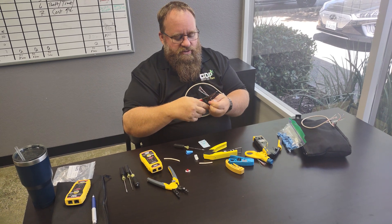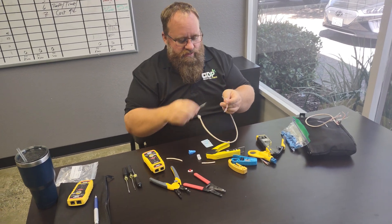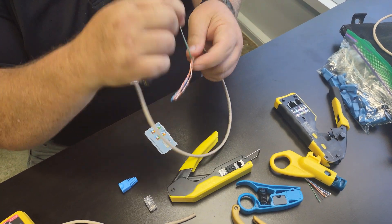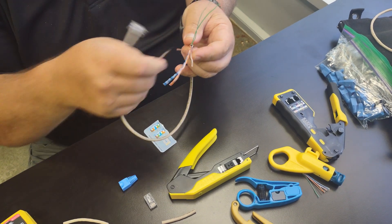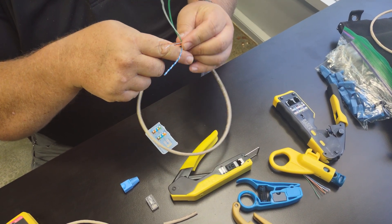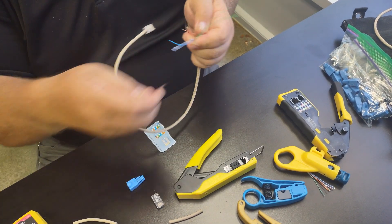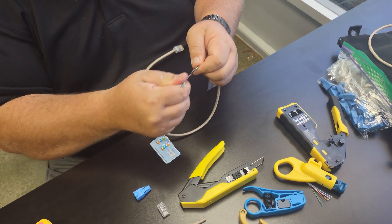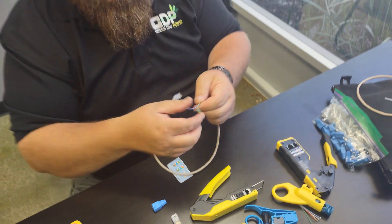First thing I do is cut away that little piece of stripping cable. Then take your screwdriver, slide it in, pull out, and you can pull out every single one and straighten them all out. Go through each one, pull through each one, and it straightens them all out. You don't have to untwist them all — that's what I hate, trying to untwist all these wires, it takes forever. Just take them on your screwdriver and make sure you've got a nice round screwdriver.